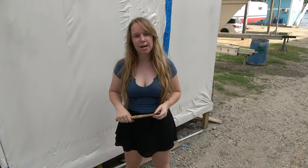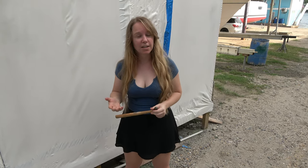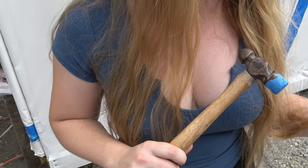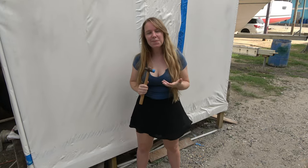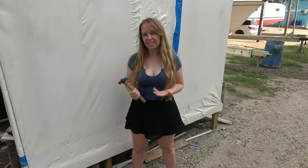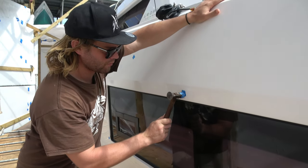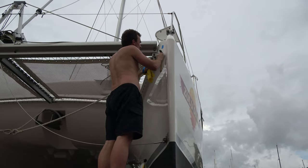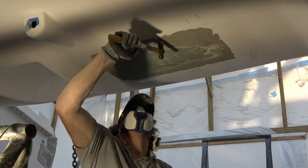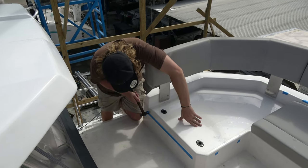Potential anomalies in fiberglass can be checked with a technical device like an ultrasonic scanner, or with something much simpler. Using a small hammer like this one, it's possible to detect anomalies in the fiberglass by doing a simple tap test. It's a quick and easy way to identify potential problems beneath the surface — all you need to do is gently tap along the hull and listen for a change in the sound. A solid constant thud usually means the fiberglass is healthy and well bonded.